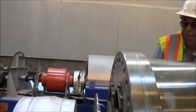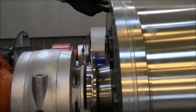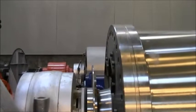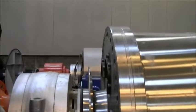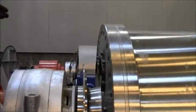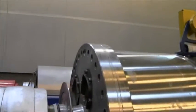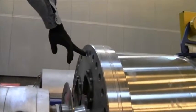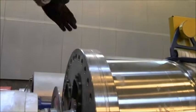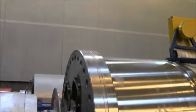This may be doweled — that may be why they quit putting the V mark on it. I always park a jack bolt hole straight up and down. In the event you take the hub and gearbox off as an assembly, it's harder to get the shaft back in — you've got to have everything perfect. I always just take the gearbox off separately. If you did take the hub off as an assembly with the gearbox, you can remove the Allen plug from the jack bolt hole, thread an eye bolt in there, and now you've got a centered lifting point. When you lift it up with that hole to the top and set it down, it makes everything easier.